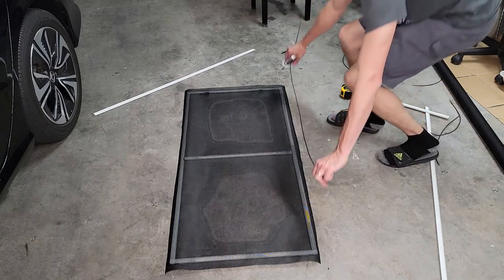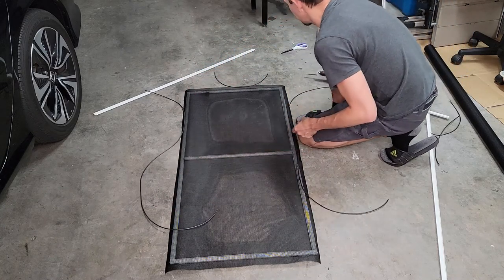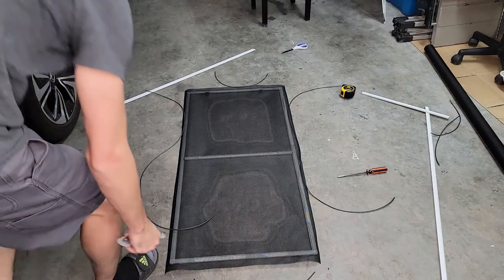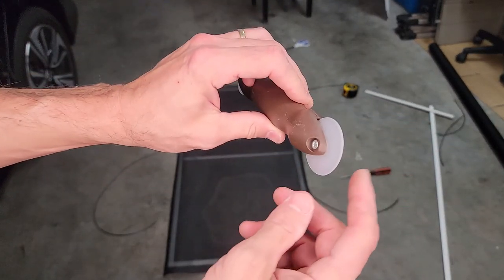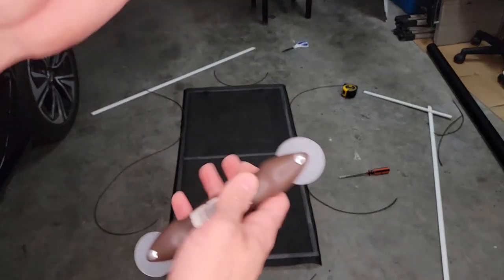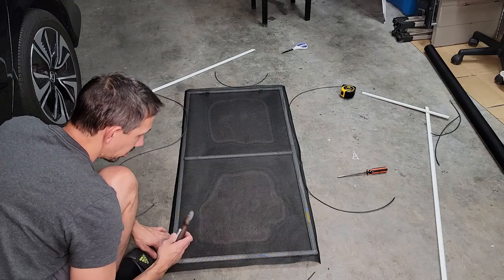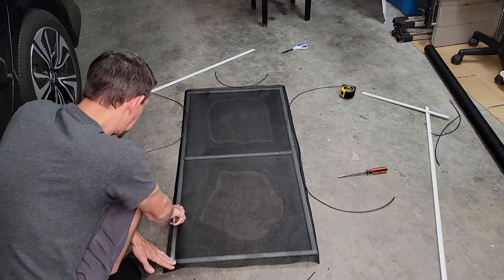this pet one. Okay, we're going to get our splines here and lay them out. I pulled them out of the old ones, or, not the old ones, but these. So you just want to start in a corner, and then we're going to go around. First thing you want to do is get, we're starting in a corner, and these little tools, this comes with a little kit you can get. I mean, these are super cheap. One's got a little ridge in there, and one's kind of pointed. So the pointed one, we're going to try to run it down the line from the corner and get our groove for our screen to go into, and then we're going to push the spline down with that. Hopefully, something like that. So, we're just going to start at a corner, and get this in the little groove there and just kind of work our way down here, guys.